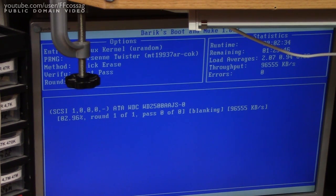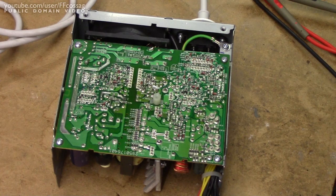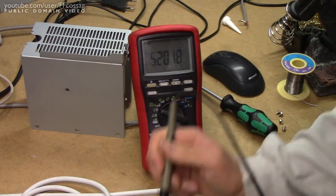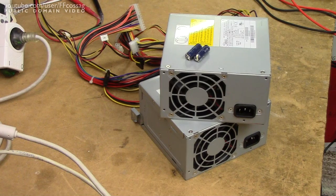Since we're dealing with an unknown hard drive that didn't originally belong to us, first thing to do: boot and nuke. While that computer runs diagnostics — which it's been doing for well over 2 hours now, so it's looking quite good — I'm going to fix the other 2 power supplies, because they all have the same issue. Since I only have one 2200µF 10V cap, I'm going to check the voltage across it. I suspect it's going to be 5V, and in that case I can use a quality 6.3V cap instead. Yep — 5V, so that's most likely the 5V standby cap. 6.3V cap it is. And there we go — 2 more perfectly serviceable power supplies.